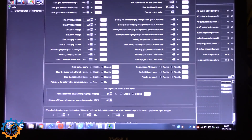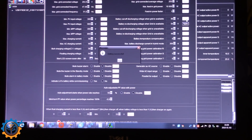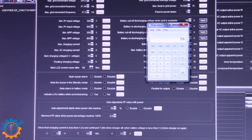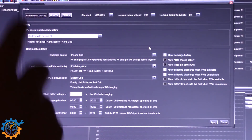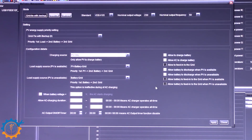So device control parameter settings — let's see what we have set here. Battery cutoff we change to 50 volt and apply that setting. And since we are running 3.5 times 16, the maximum voltage should be 56 volt. Floating, we set that to 55.8, apply. Grid tie backup number 2 — apply that first, and now it will be clicking I think. Charging, PV only — apply.